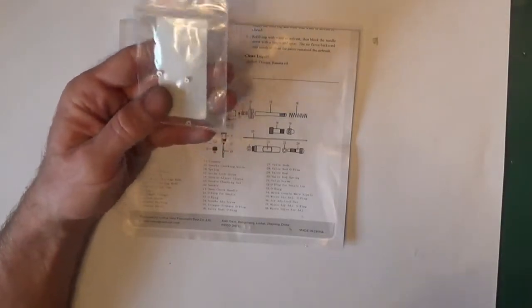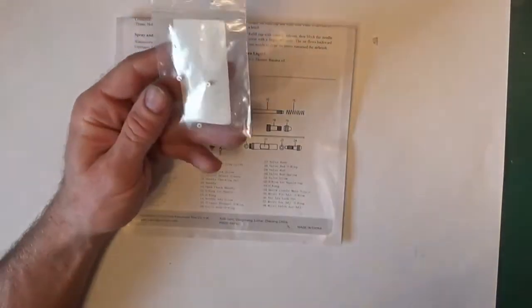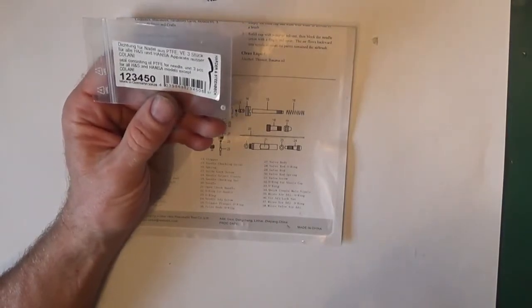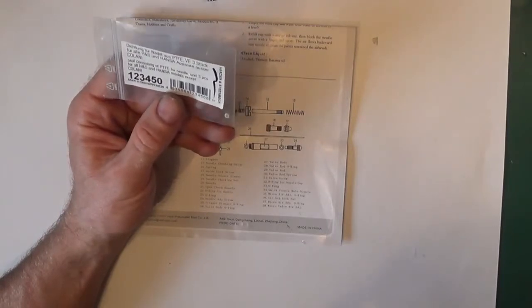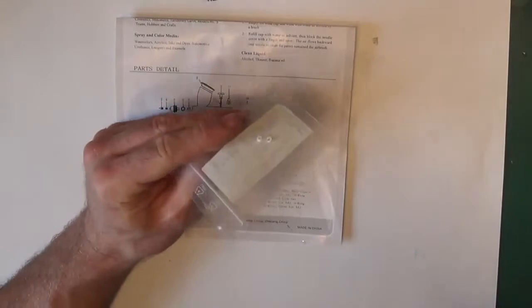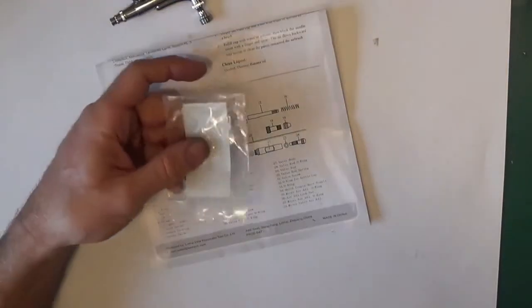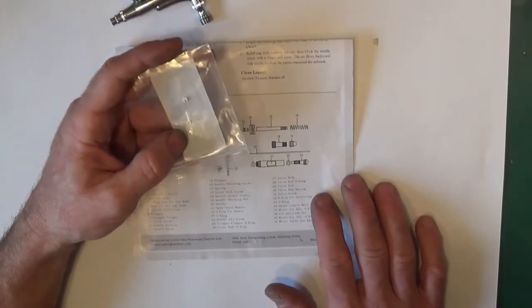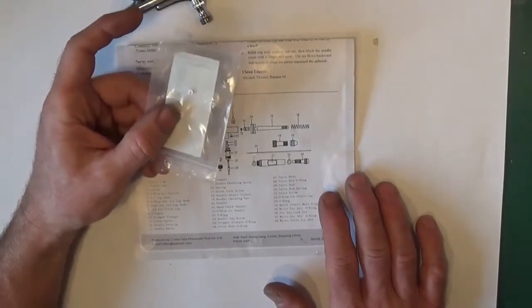If you've got the O-ring as the main packer bush, which is the one that the needle goes through, these are the alternatives, which are PTFE bushes. This one happens to be for the Steenbeck, but it does fit. You can replace it on all of these because I've done it. This one also fits in the Neo. Several people have done it. I tried it first, and they have actually used them, and yes, they do work at a fraction of the cost. These are less than £1.50.